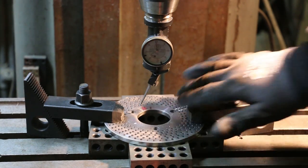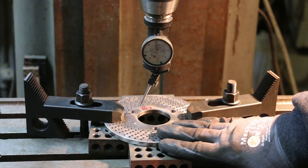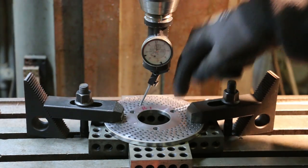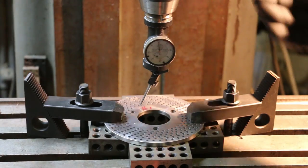Alright, I'm setting up for the second plate now, and I'm going to use a different method just to show you a different way of getting the same job done. There's more than one way to skin a cat, and there's probably even more ways you could do this. These are just two ways I'm set up in my shop to drill these bolt hole patterns. The second method is going to be using the bolt hole function on my digital readout. In this way, I've taken it off the rotary table and just bolted it down to the table on some 1-2-3 blocks. The first thing I need to do is get my spindle centered up on the center of the part.